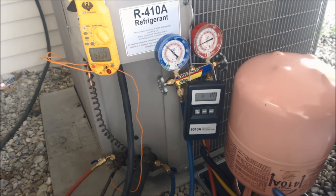We've got five pounds now. As long as we can keep gaining on pumping the refrigerant into the system from a point of not even turning the compressor on, we're going to try to get in as much as we possibly can. Now we're approaching six pounds.